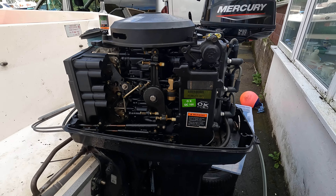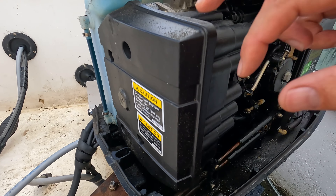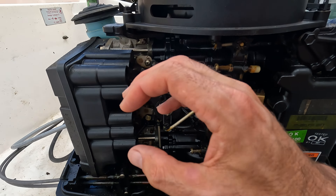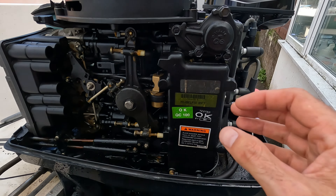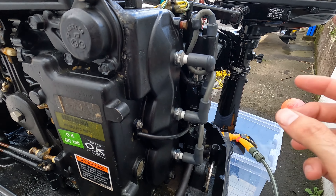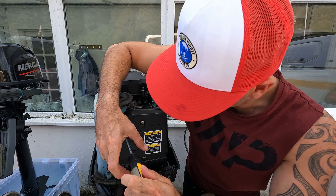The cover's off now on the Mariner 60 Bigfoot, which has been fully flushed. What we're going to do is take the air box off for the carbs underneath, and then we can apply fogging oil — which is a wax-based oil that lubricates the inside of the engine. Then we'll do the same into each cylinder by taking the spark plugs out and squirting inside, giving it a quick turnover. Worth remembering this engine is 24 years old.